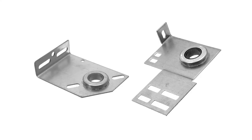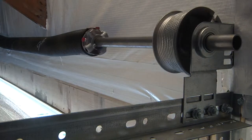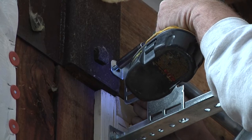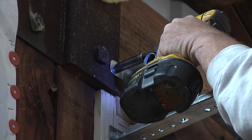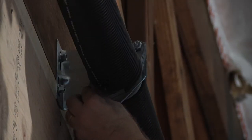There are two different types of plates: the center bearing plate and the end bearing plate. The purpose of bearing plates is to allow the shaft to spin freely and still be securely fastened to the garage wall. Bearing plates will also keep the shaft aligned with the other counterbalance components and the rest of the door assembly.